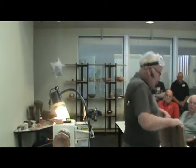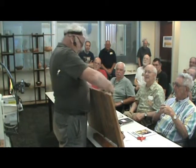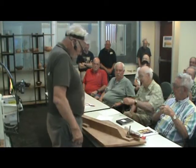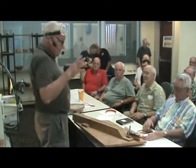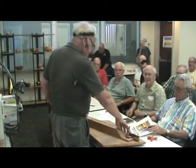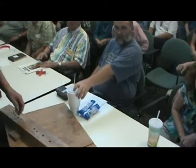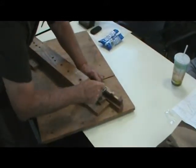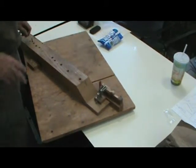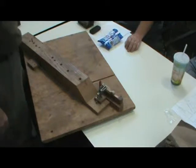This is an eight-sided sled. I've made it many different ways — I used to make it out of one-inch wood and was always cutting them in two. So I finally made it out of a nice thick piece of wood. There are two things that are important with a segment: they all have to be exactly the same length. This stop block takes care of that. If I need a two-inch segment, I set it to two inches, clamp it down, cut the first end, turn it over, put it in, cut again, and keep turning back and forth. That takes care of the length.